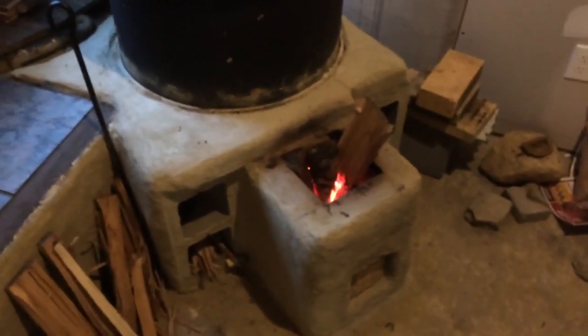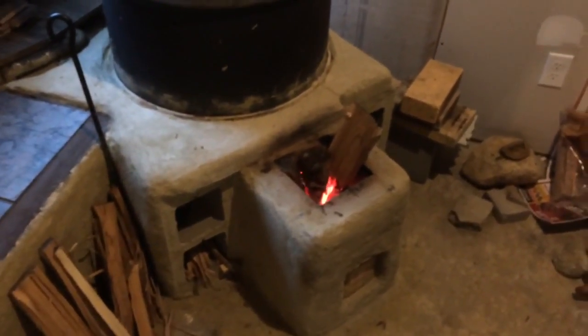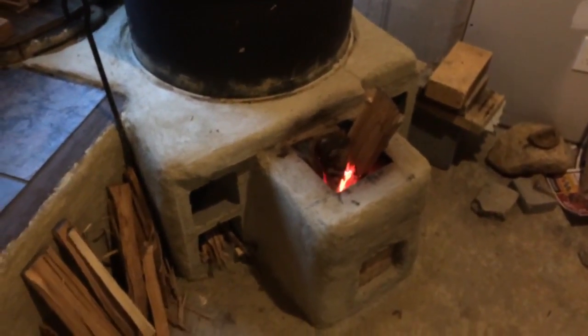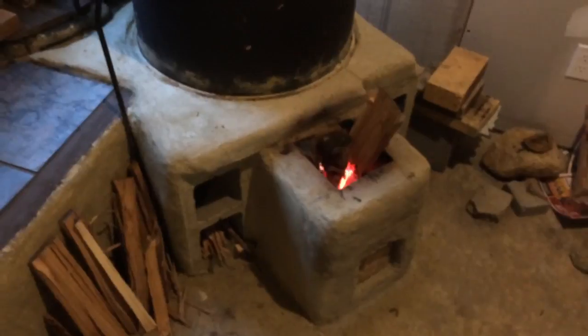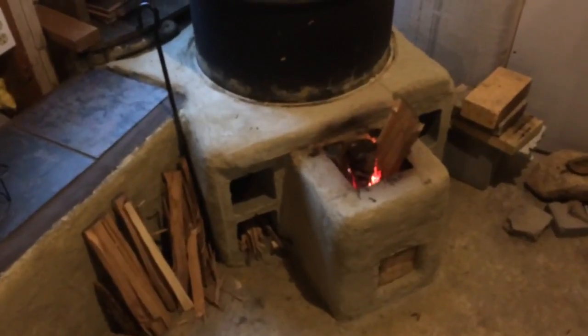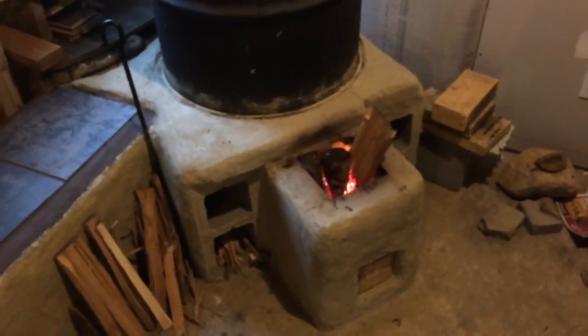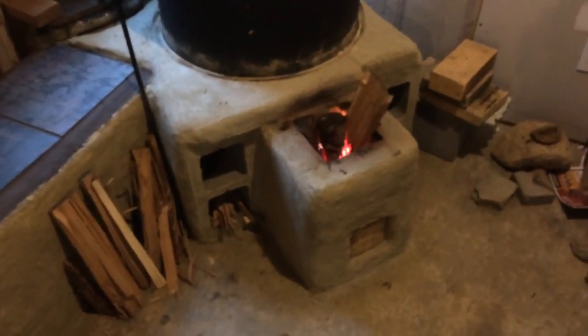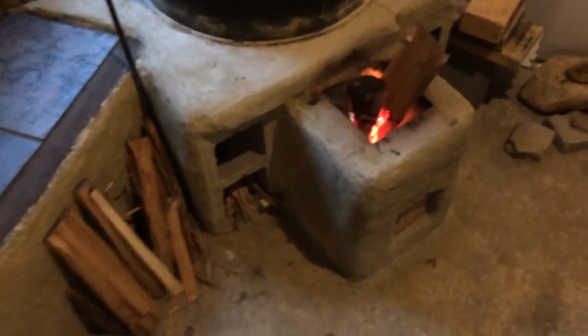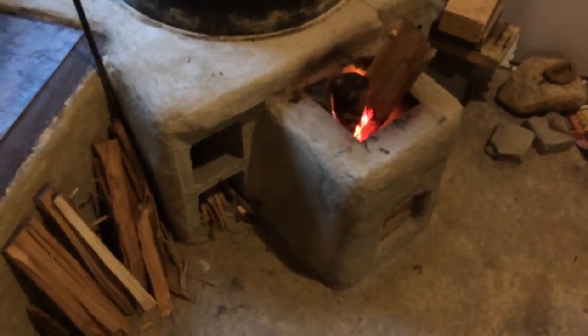The coating on the side is not a pure cob. What I did was I collected the red clay — the orange clay that's in this area — and I mixed one part clay to one part concrete, and it was a special concrete that resists cracking. Look real closely — you can see a little bit of cracking, but not bad, and we can always do more coatings later.